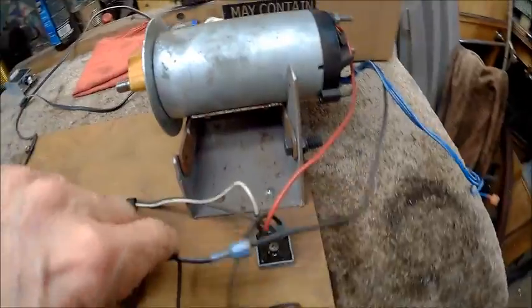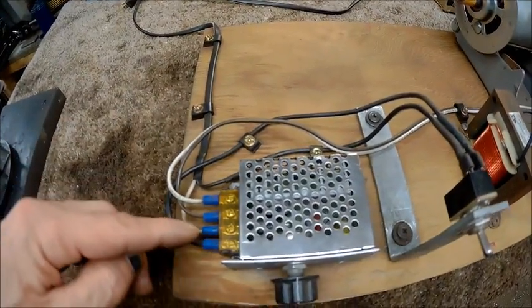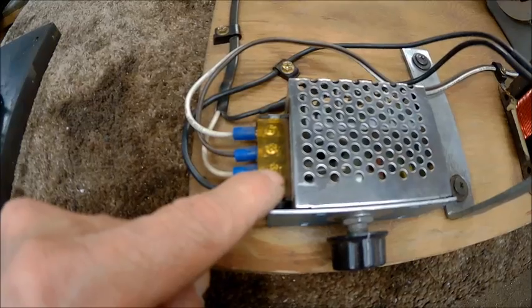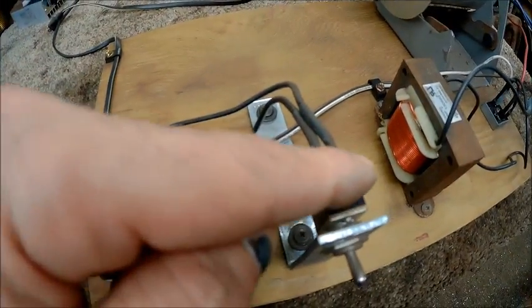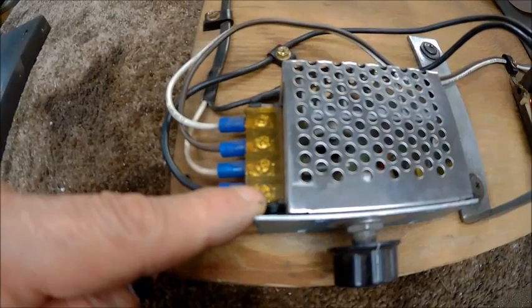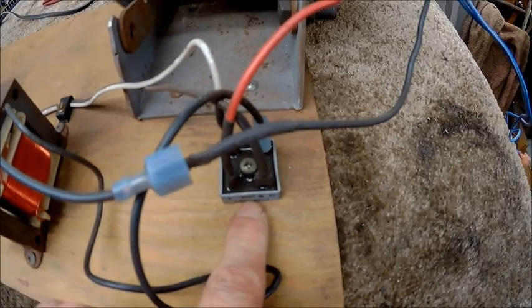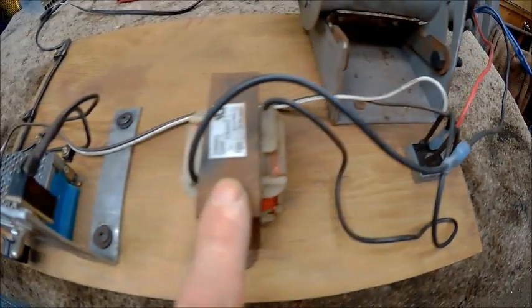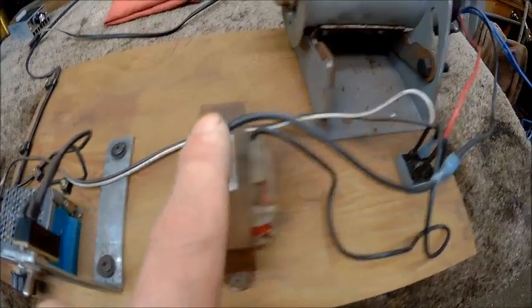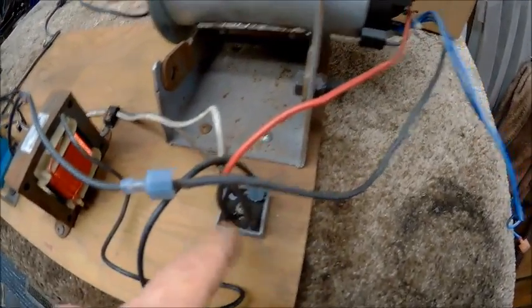So I hope that helps you, Robbie. I'm going to go through this one more time. You have your input going to the one side on the input lug. Then you've got your AC black going to the switch, and then back out the switch, and then to the other side of the input lug. Then you've got your black and your white - I've got brown but we're calling it black - going to the AC side of the bridge rectifier. Then we're going to have the DC black negative 12-volt go to the transformer. Then the other wire on the other side of the transformer will go straight to the motor - it's just an inline transformer. And then you have the red going straight to the motor.